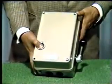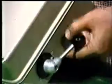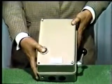The motor starts rotating. Once the motor picks up speed, we move this switch to delta position. The windings get connected in delta and we can release the pressure on the push button. The motor continues to rotate. Now let us see what is there inside a manual star-delta starter.